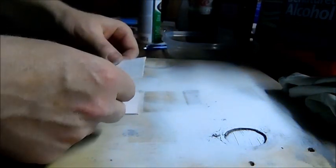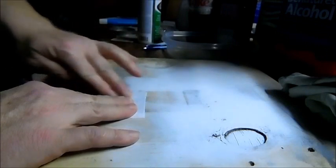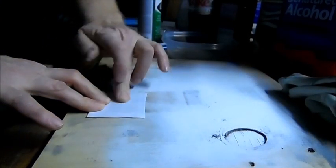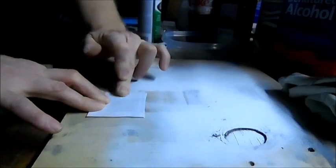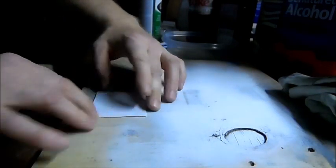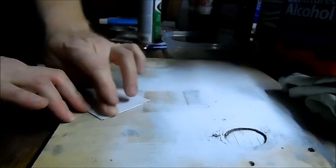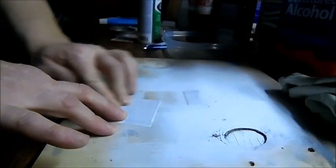Take your design and lay it on there. Once you've laid it on there, do not move it — get it lined up just how you want it, lay it on there, hold it with one hand, and rub over all the toner with the other. The reason I say do not move it: as soon as that toner touches the lacquer, it's going to start to transfer. Not fully, but part of it will transfer, and if you move it you will smear the design and ruin that go-around. It won't ruin your PCB — all you have to do is wet down your acetone rag, wipe it off, and start again.